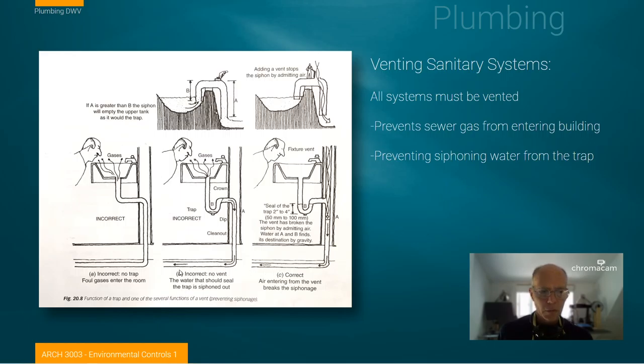With all of that, we have the idea of venting. Venting allows air to properly move through the system in ways that don't allow noxious gases to enter the home. If you just think about a pipe coming up to the floor that drains out to a sewer drain with nothing blocking the flow, any gases in the sewer would easily enter the room. A millennium ago, the concept of a trap was invented. The trap seals that air opening. Without a vent, a column of water can actually siphon all of the water out of the trap and cause it to fail.